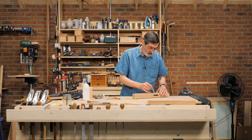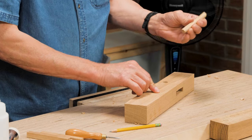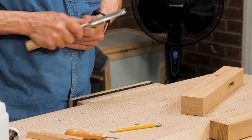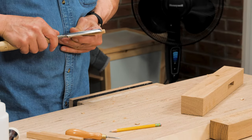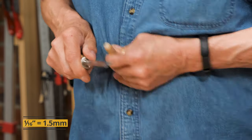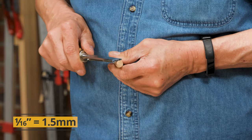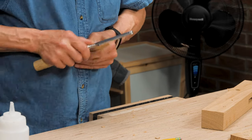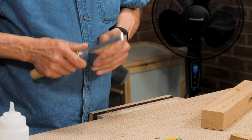So this does fit inside the hole. I've got a tapered start but I'm going to taper it even more here because I want it to go past that one-sixteenth step inside the hole so that it doesn't break it away.